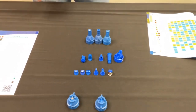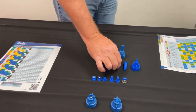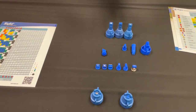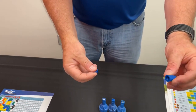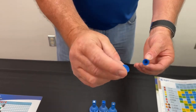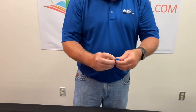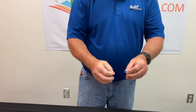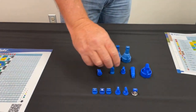These are all air inducted nozzles. What does air induction mean? Air induction nozzles have a metering orifice and an exiting orifice. As you can see here, this is an AIXR 110-03 and this is a removable orifice — this is what meters it, telling us it's a 0.3 gallon per minute nozzle. When it exits this orifice it's a little bigger, which creates a bigger droplet. When it does that, it pulls in a little air to create a bubble — that's the air induction. It's pulling in air as it sprays and creating a larger droplet size. Those are very popular for drift control and they work very well.